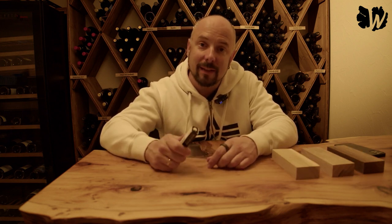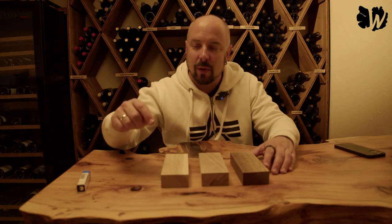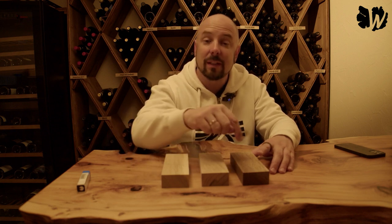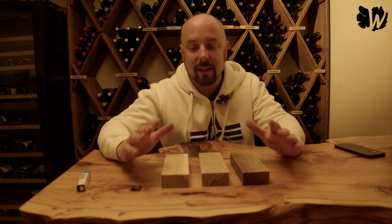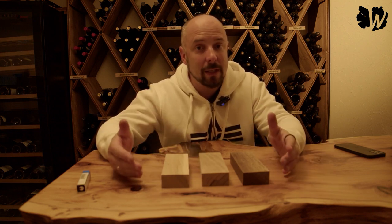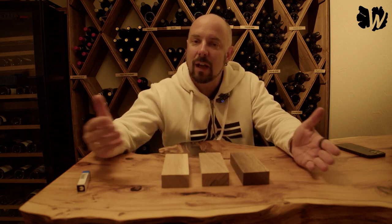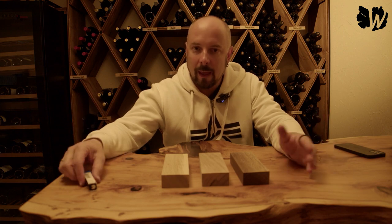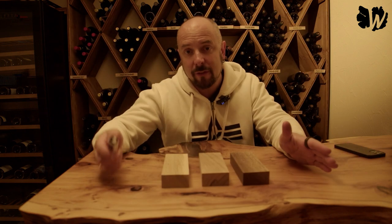So I decided to test this bit with my typical scientific approach. I took three pieces of wood: witch elm, walnut, and wenge. Witch elm is soft, walnut is a rather hard wood, and wenge is a tropical wood — really hard, much harder than the walnut. I decided I would do some 20 millimeter deep pocket cuts on these to test out how well the bit works. I did some research and figured that the optimal router speed for the Shaper Origin is 5 for this bit.